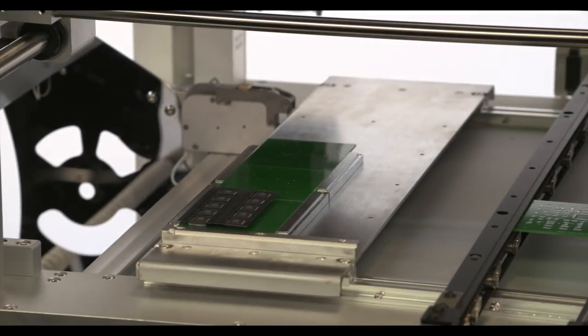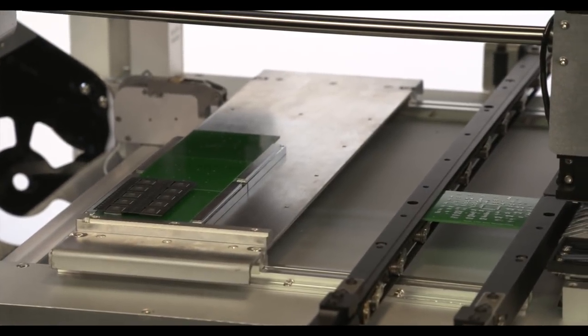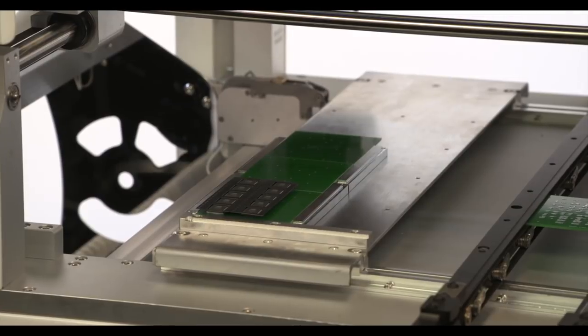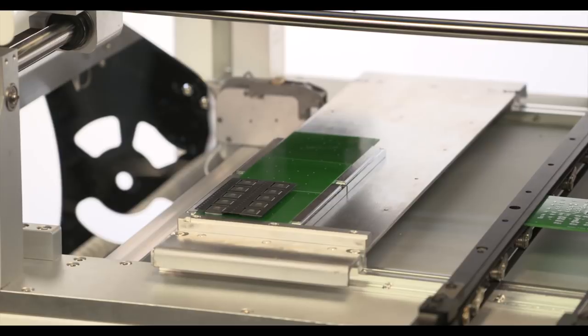The next thing we're going to set up is the chips we're using. To do that, we're going to use tray fed chips, although for this demo, I've actually configured them as short tapes. This is kind of a neat feature because when you don't want to buy a whole tray or a whole reel of some expensive components, you can simply take a little snippet, as we've done here, and I've used the magnetic fixtures with some extra PCBs as a stand and double stick taped the short tapes there.